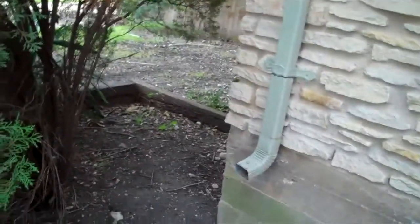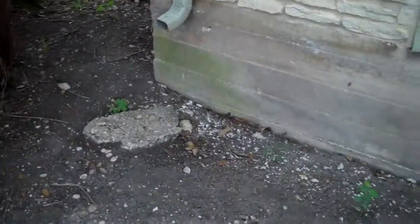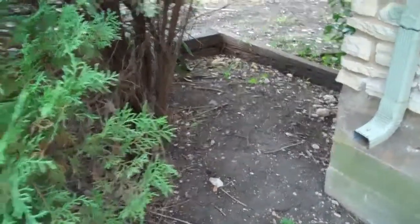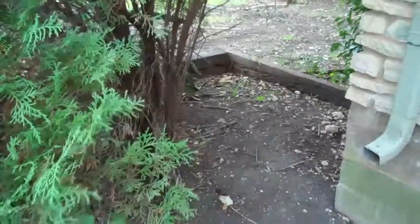In this area of Williamson County, it has a very heavy black clay soil content, which means it needs the best water protection it can have — to get the water diverted away from the foundation instead of letting it pond around it and creating wet spots and soft spots in your bearing soils around your foundation.